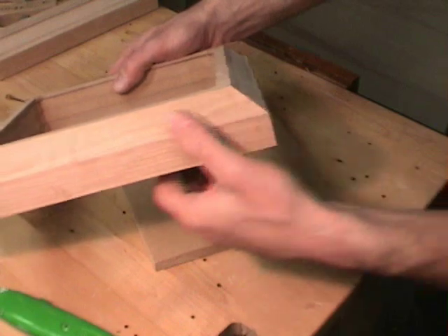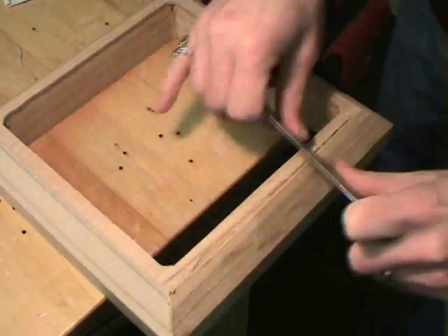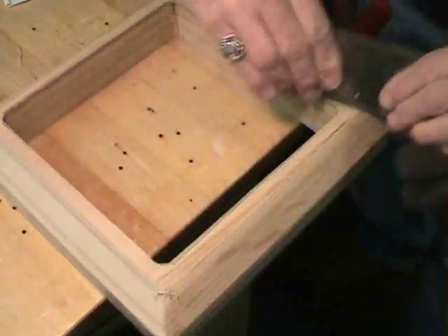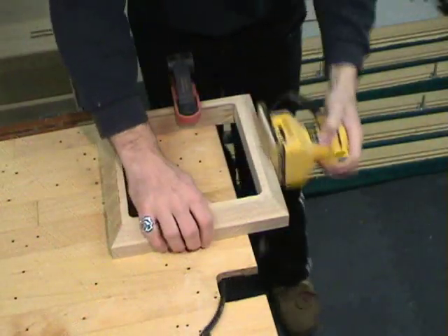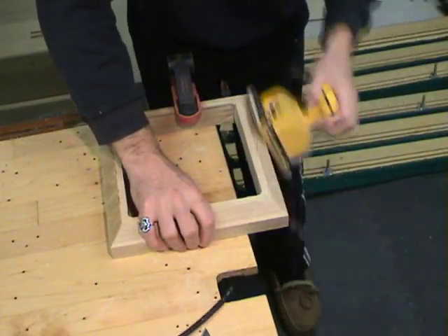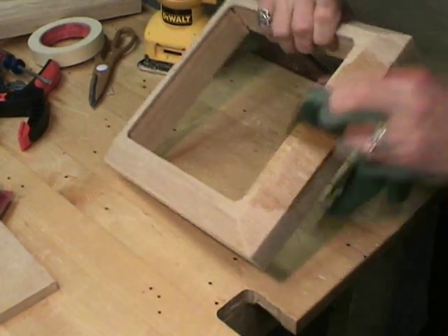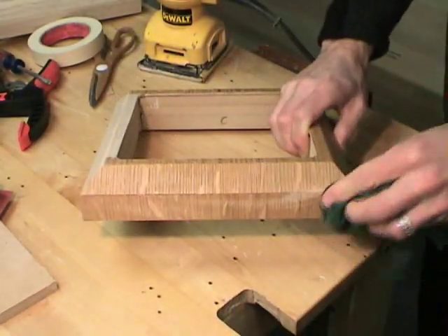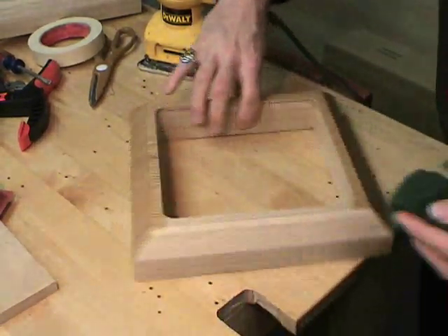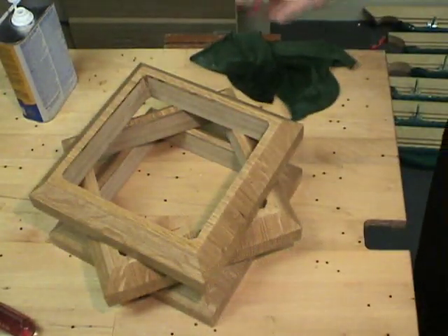I like how adjoining sides begin to look like real wood when they're blended together. For dried glue and other stubborn spots, I use a card scraper to flush up the surface — this works really nice and leaves a smooth finish. Final sanding with 220 grit sandpaper and the finish sander makes the veneer on the feet blend together and look great. Here I apply mineral spirits to highlight the grain, and you can see how alternating the grain direction gives the feet the appearance of real wood. Quarter sawn white oak looks great and I think these feet are really going to add to the substantial look of the leg system.